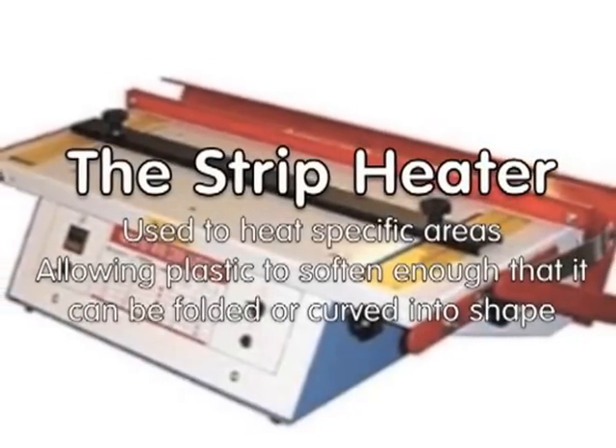Now you need to bring your card, bring your plastic. There's a switch at the back. We're looking at the back of this machine. You need to turn it on and off. This is a hot wire strip heater, and this bit here is the hot wire. That gets very hot, so don't touch it with your fingers. Line up the edge of the card with the hot wire and leave it there for about 20 seconds. Do not make the plastic touch the hot wire — it'll burn, it'll melt and leave horrible melted black stuff in there. So fold it, press it flat. Once you've done the first one, just lock your card in. It's best to do the sides first, because then you don't get the tangle.